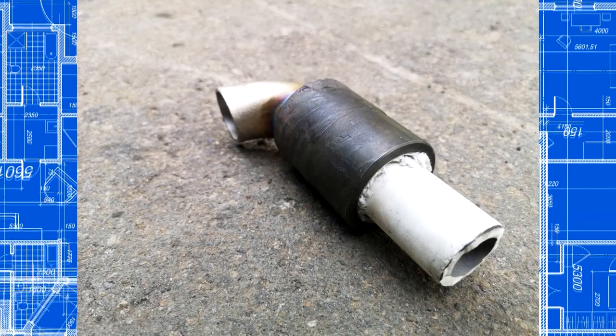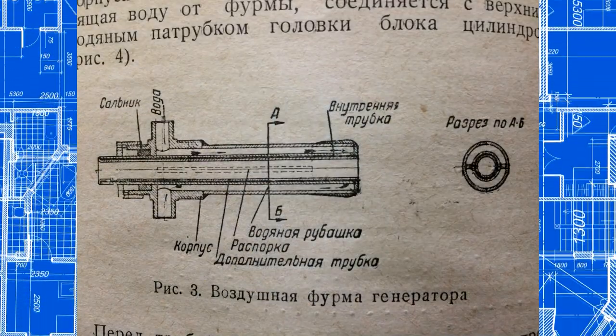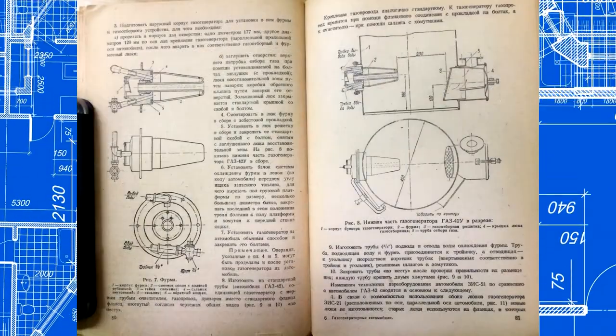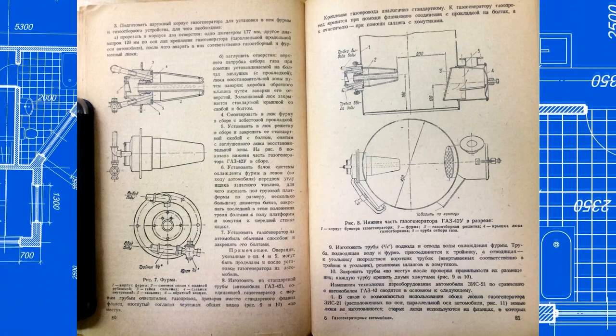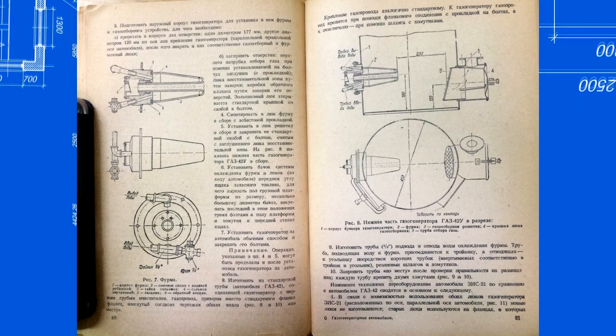The only long-term feasible solution without any manipulations with the tuyere was water cooling. The upper part was made of copper and water ran from a water tank. The temperature raised to about 1,600 degrees Celsius at the tip of the tuyere at a blast rate of about 50 meters per second.